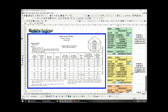You're the weld engineer. You've got to validate and verify all these numbers and go over it two or three times. Look at it from different angles, different points of view, different concepts, have multiple ways to find the same numbers and the same conclusion. And if you find an error, then you're kind of on your own. You need to determine now, as the welding engineer, what is the real value that you need to put in your design, and you can back that up mathematically, okay?